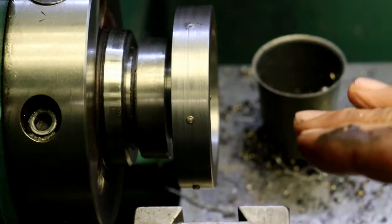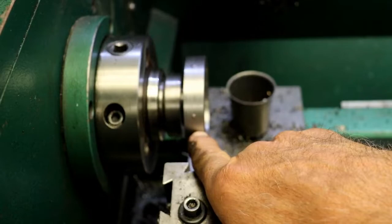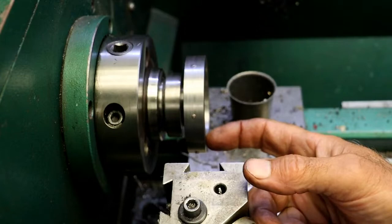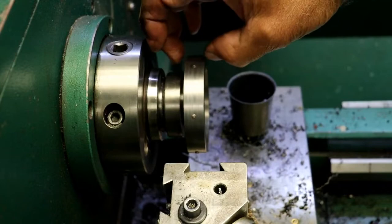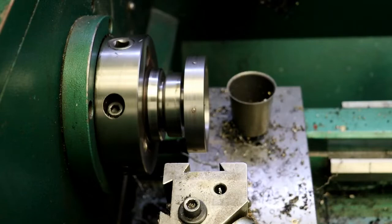I'm going to leave it set and make sure that the Loctite is set up real well. I'm just going to leave it lay there. And when we come back to it, I'll touch and cut these pins down, and I'll come in with a tool on this side and face this and then face that. These sides are going to be painted, so I want to face it. I'm amazed that you can see that 5 thou wiggle in it, but I'm going to get it so that it's true. It'll be zero. Wow.